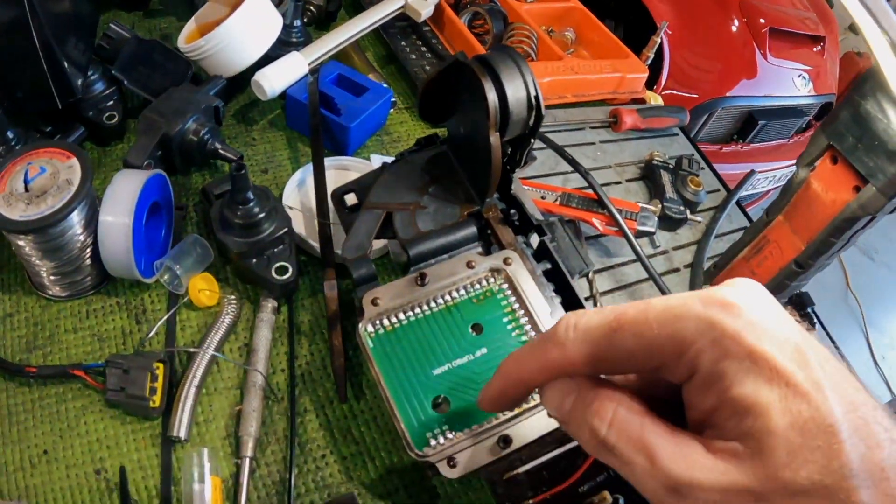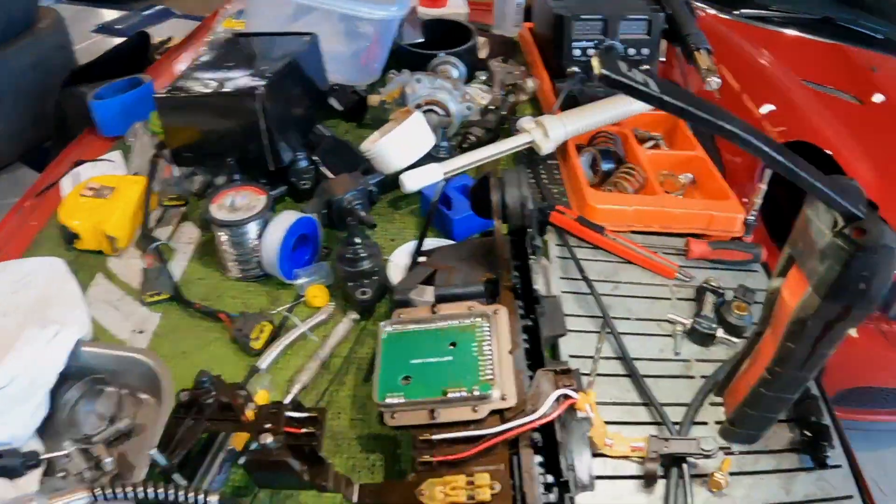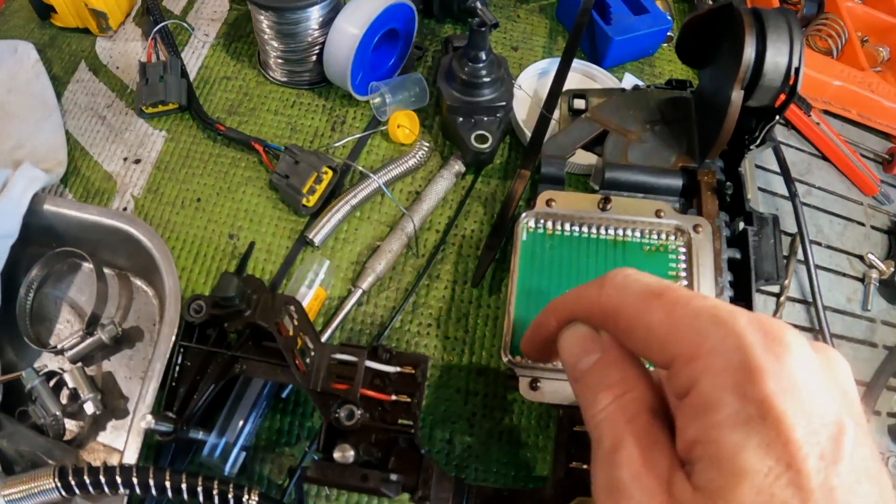Hopefully that's going to sink into a few people that have had the problem. I know people that have been in my situation where you haven't had issues soldering before, and then you really struggle to get the heat to go into these boards. I think it comes down to the way I was cleaning off the original TCU connections — I normally just break them off with a flat blade, like a knife. Some people might file or grind them off, and that little bit of a file is enough to get the solder to stick really nicely. If you're doing this, make sure you give the pads a little bit of a scuff up.